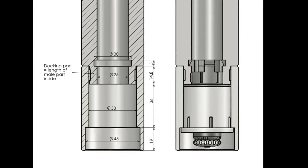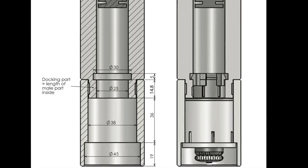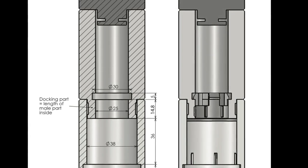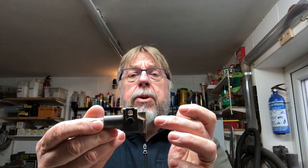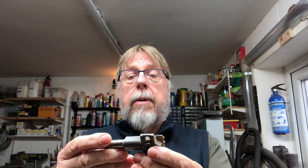This is an extract from the Axminster instructions on what they call the wood crush grind. You'll see you need to drill a variety of holes: a 25mm, 38mm, and 44-45mm diameter hole. That's best done with a Forstner drill or series of Forstner drills. I actually use an adjustable-width one — an Axminster one. It isn't the easiest to use because it has an outrigger leg rather than teeth all the way around like a Forstner, but used carefully — as it's carbide — it substitutes for quite a few individual drills.